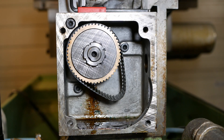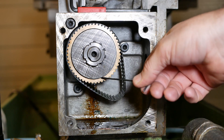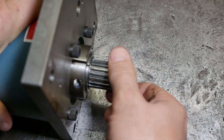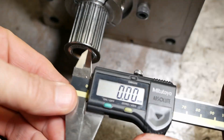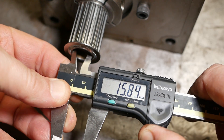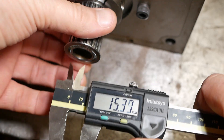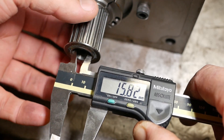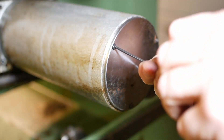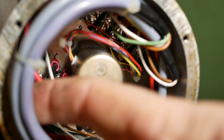I'm not really sure why I thought it was a one-to-one reduction — turns out it's seventeen to fifty, so nearly three to one. The motor itself's got this pretty chunky coupling on it with the pulley. The motor shaft is 15.8mm — that seems weird. I wonder if that's some sort of imperial dimension. That's a bit of a pain. Well, while I'm still pulling things apart I might as well do this too — I've given a bit more free wiring here but otherwise the hookup looks the same.